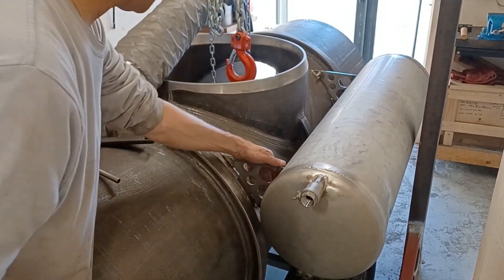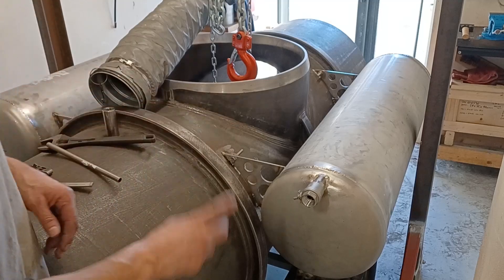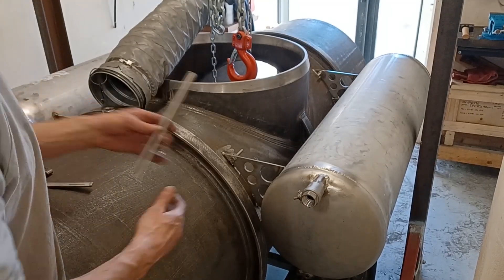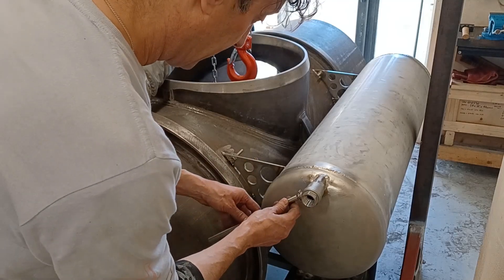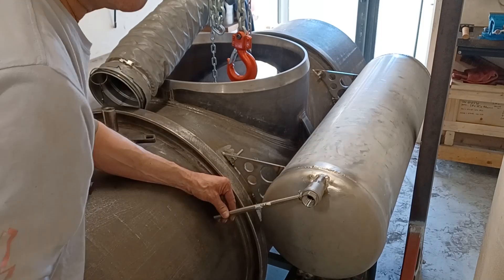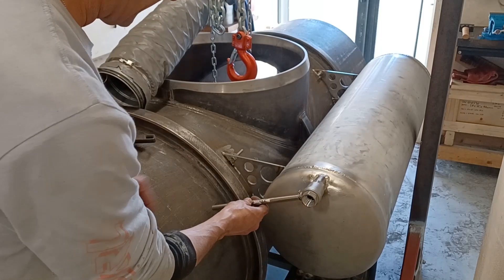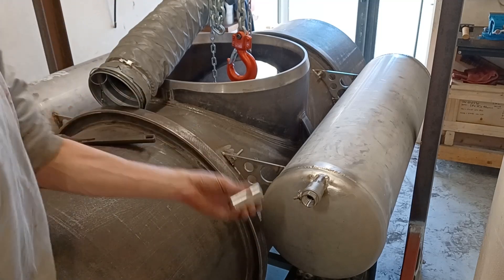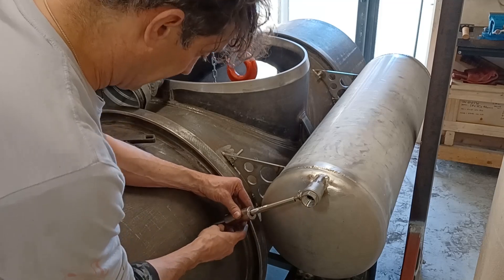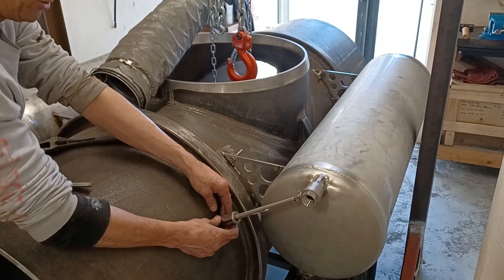I've welded on the other brackets properly so the tabs are all on. Now I'm lining up to measure the through hole. I've got this piece of tube that fits over there — this is the whole point of doing these first, so I can get this angle and get them in the right place. This is a through hole that's going to go through, and I'm just going to line this up on my CAD drawing.